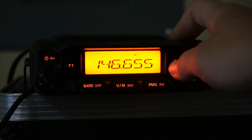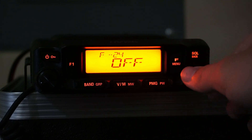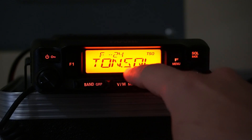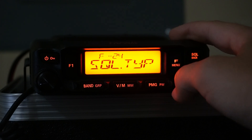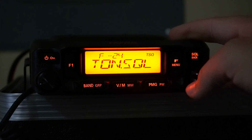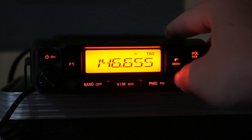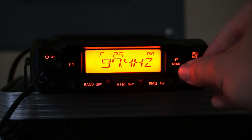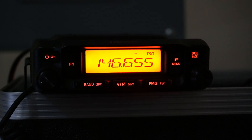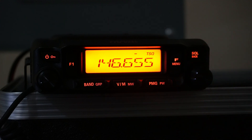Next I want to set a tone. I'll go to menu option 24, squelch type. Tone encoding means we send the tone to the repeater; tone squelch means we send the tone and also don't want to open our squelch unless that tone comes back. I'll tap to select tone squelch. Then I go to menu option 25, squelch code, and let's say I want 100 hertz. Now we have basically a fully configured repeater — if I key this up, you'll see the offset and the 100 hertz tone are active.